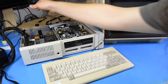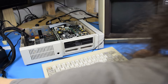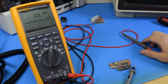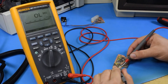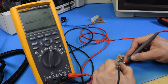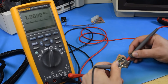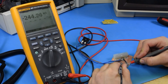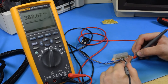Let's turn on the power supply. That doesn't look good. The power supply is clicking like crazy. What is going on? I don't think it's my wiring — I think it might be my copper clad. If I go from one isolated pad to another, that's really low resistance for something that should be completely isolated. I get a more reasonable value over here. All of them on here are really bad. How do you even get a negative resistance? These should be considerably higher than that. Maybe my ghetto etching didn't work out that well.